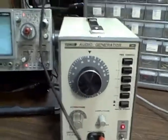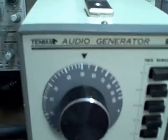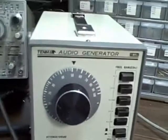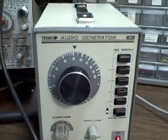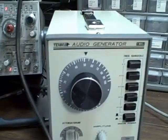I've got it hooked up right now to a frequency counter. What we're going to do is change the bands. We're going to set this thing at mid-scale, and as we change the ranges, we're going to see just how close we hit to mid-band for that range — kind of an idea of how decent the calibration is on the vernier.